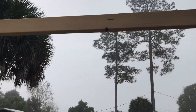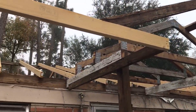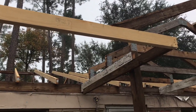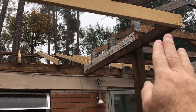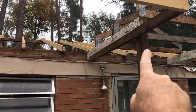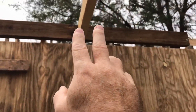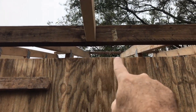This two by four, which is basically the overhang — you see you've got the whole overhang, the sub fascia everywhere on the house. Well this overhang here is going to be four two by fours, and those will tie in on this end of that triple two by six with that cantilever. Remember, as this pulls down, that's going to want to go up. These legs are going to keep it from going in, and back here is going to keep it from popping up on this end.